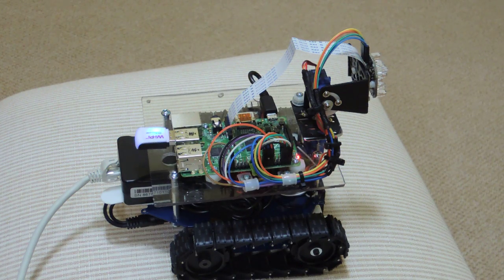On the software side, I'm running Noobs OS — the Raspberry Pi operating system. I had worked a little with Linux in the past but this definitely took me to the next level; I'd say I'm now a good intermediate-level Linux administrator. Another software module I used is WiringPi, which is GPIO control software. One of my first software struggles was managing the GPIOs without requiring sudo, which Raspberry Pi has designed in for some reason. WiringPi actually allows you to control the GPIOs without requiring sudo, which is great.